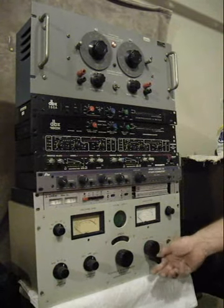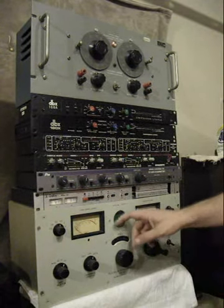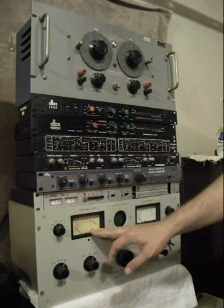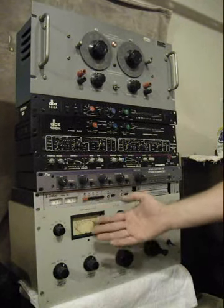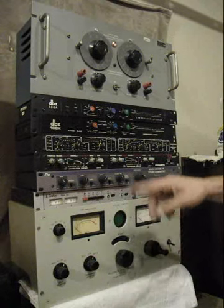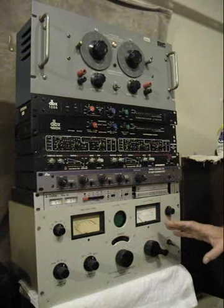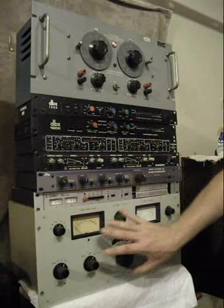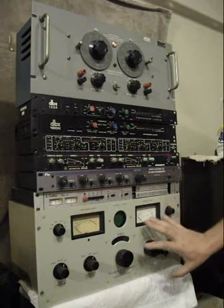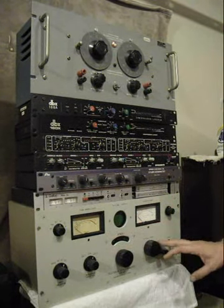Any device that actually has a Bakelite kind of crank on it is just kind of cool. You've got a waveform monitor in here which will show you the oscillator frequency. You've got a meter input for your sync level. So if you've got pilot tone or something coming in, you can key it in that way. You can synchronize two machines together using the 60 cycle sync method. I mean, we're talking about something really from the 50s and early 60s here. So when I say there's maybe a half a dozen or 20 people in the country that know what this device is, they're going to be glad they found it, because for what it is, it's exceedingly rare. It's the coolest way to do vari-speed on those vintage AC motor machines.